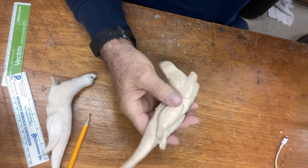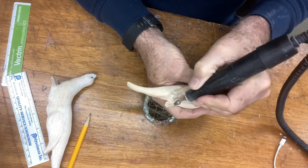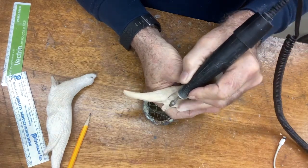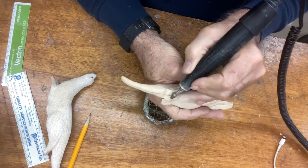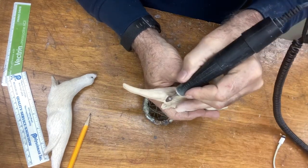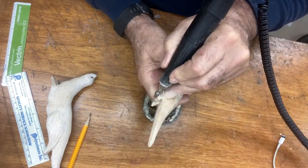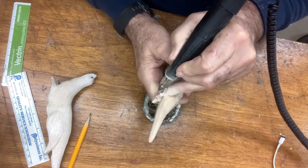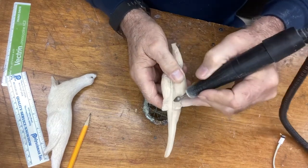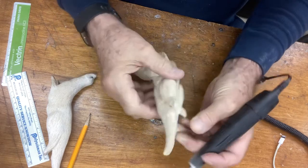And I'm going to do that with the pear. So here we go. I'm going to come in here, and I'm going to take that down. Just like that. And I'm going to try to do that like I'm looking straight down through it, like we're routing it out. Then I'm going to go to the other side and do the same thing. I'm going to just do the one foot at a time. Bring it down so that it's completely flat right across. And we thin it out, but it still has a little bit of a flat in there, and that should be for both of them.